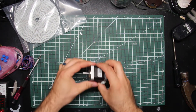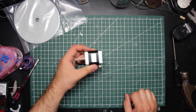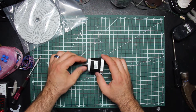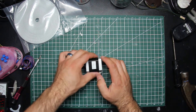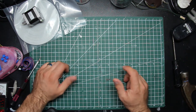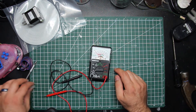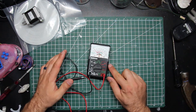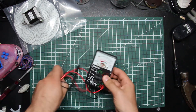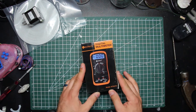Let's talk about what I'm going to do tonight very quickly. This is a stepper motor that burnt out. I tried to adjust the potentiometer supplying current to it and that went poorly. Now that I have a working stepper motor installed, I need to go back under to the stepper motor driver to fix it. I had this multimeter, but it's not nearly sensitive enough — it only gets down to about 10 volts, and I really need to see less than a volt. So I ordered this off Amazon.